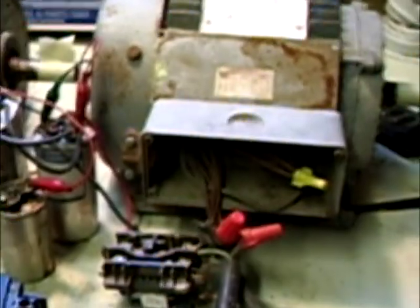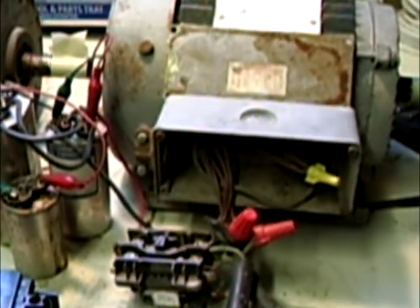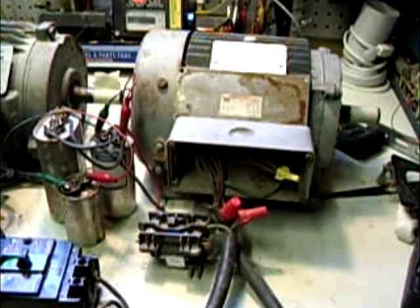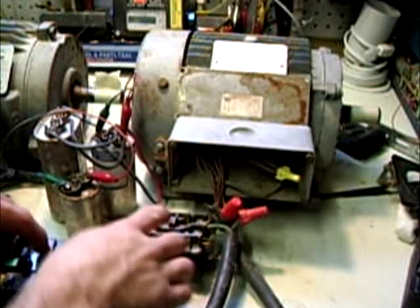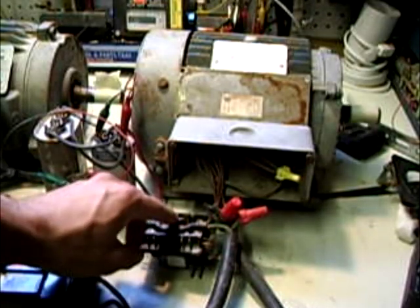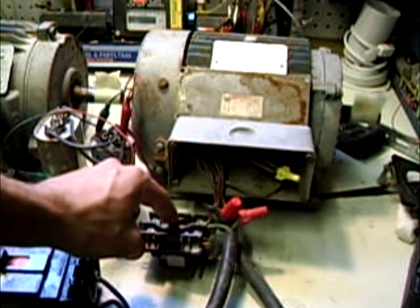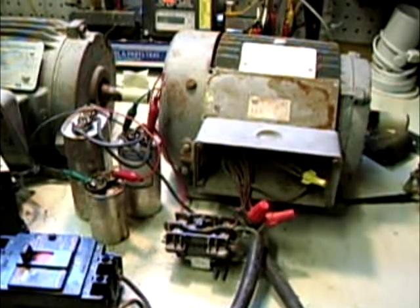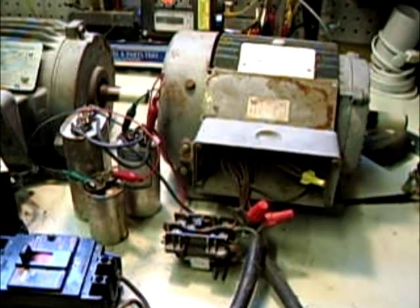Instead of sitting there using another motor to start your idler generator, I'm going to use a momentary contact switch. When you start up your three-phase motor, it drags — it doesn't like to go. When I push the momentary contact switch, it's gone, just like that. This is a semi-automatic circuit. Now you can use this other contactor to start the other motor, just like that.